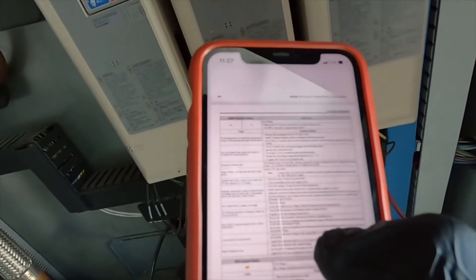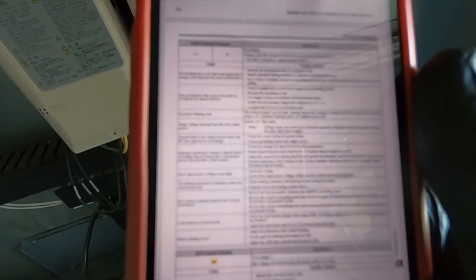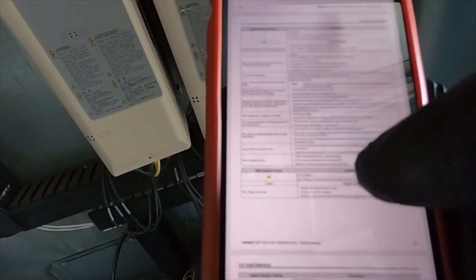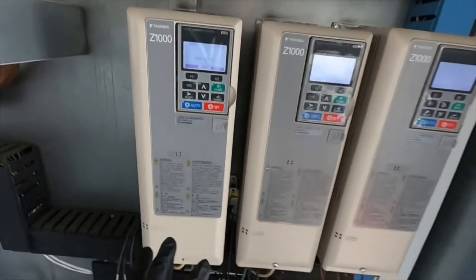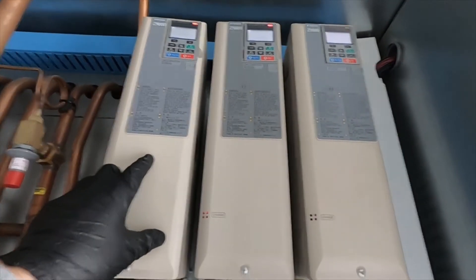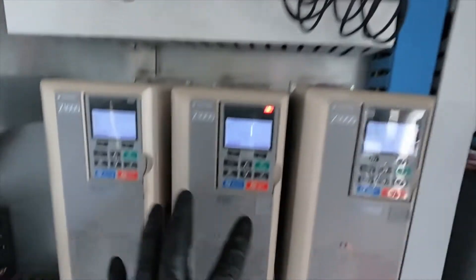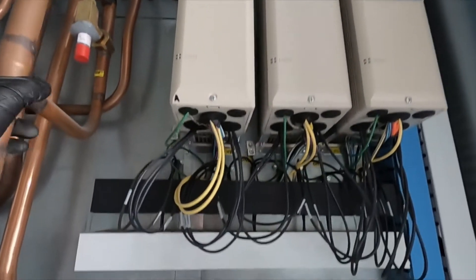If you go up to OV — which is right above OV2 and is on that quick guide on the door — look at all the possibilities you get for causes and possible solutions. I take that OV alarm into consideration as well because it is an OV alarm. The OV2 is telling me the wiring is too long, but I've got two return fans and three supply fans, and only one supply fan is showing this alarm. The return fans are further away and they're not alarming — just this one. Common sense knocks out the possibility that the wiring is too long. I call bullshit on that.